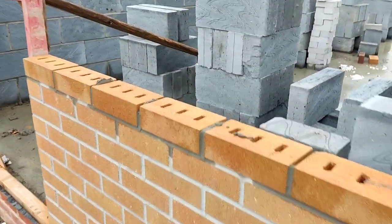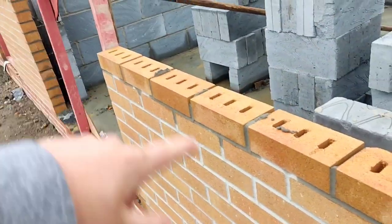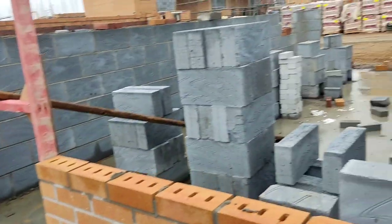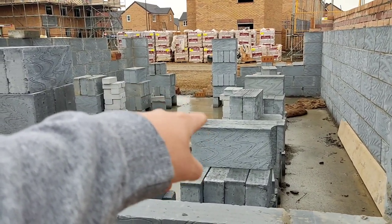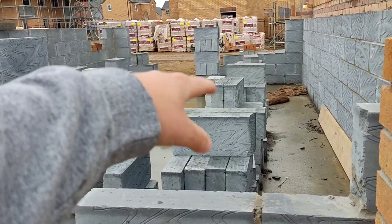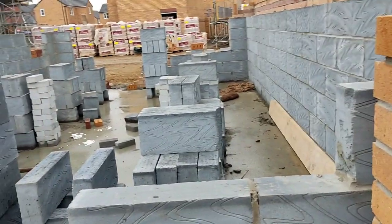Finish this off. I'm gonna put the door frame in here, clamp it on, put a block up to there, get that nice and sturdy. Then I'll finish the brickwork up on the back to full height, and then we'll attack the front brickwork. I'll probably put that little front nib in as well. So I'll nick that door frame from there, put it there. That bit of front brick where I'm running, so a bit of a steady day for when we're coming back.